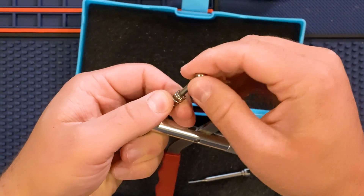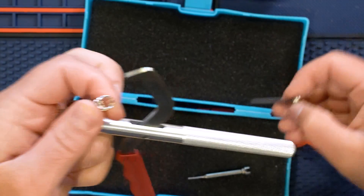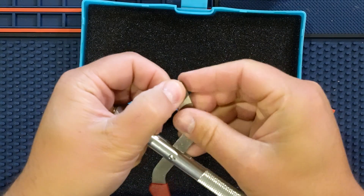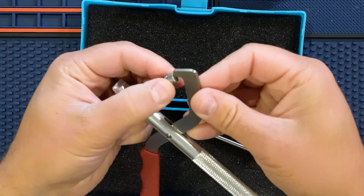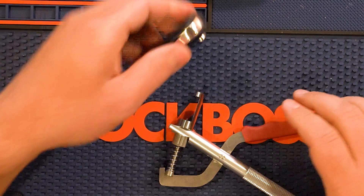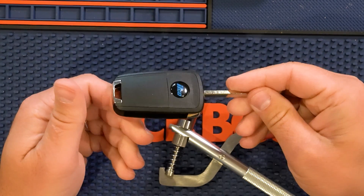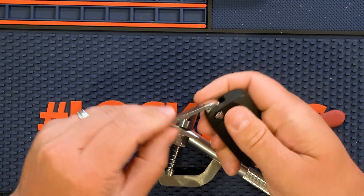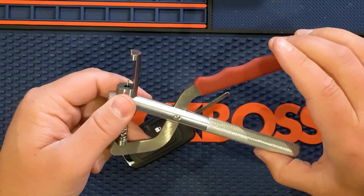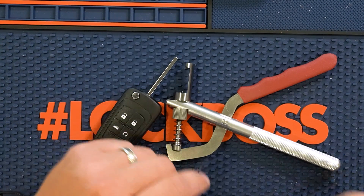Now I'm going to move this brand new one aside and grab mine that I've been using. We'll start with putting an ejector pin in. To swap them is really simple — you just lift this up, take it out, and get it put back in here. There's just a little slot on there. Now let me grab our first remote. I've picked on this one a lot but let's do it one more time for fun. This is the GM flip key. We can move it and see the little roll pin sitting there. For the most part, this is all you're going to need to get it out — just a nice firm, straight applied pressure will typically get it right out.